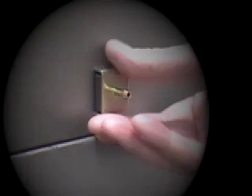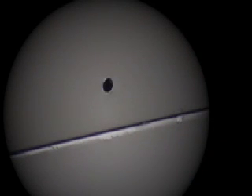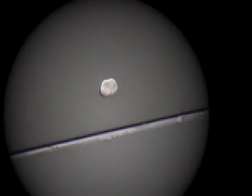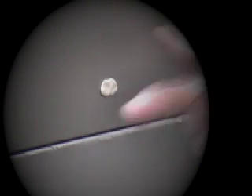Now we've drilled our 3/8 inch hole — it was just that fast and easy. As you can see, our static pressure probe fits through easily and the magnet sucks it right up. When we're done measuring airflow, we can plug the hole with a plastic plug for 3/8 or a readily available material is thumb gum. Both do a good job of sealing and you can remove it easily later if you ever want to take another reading.